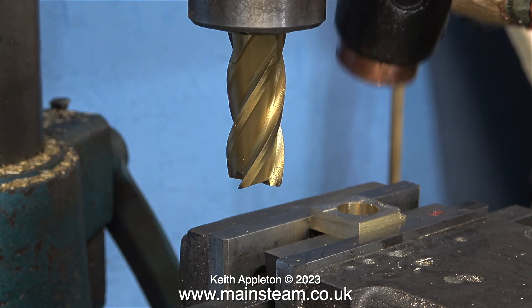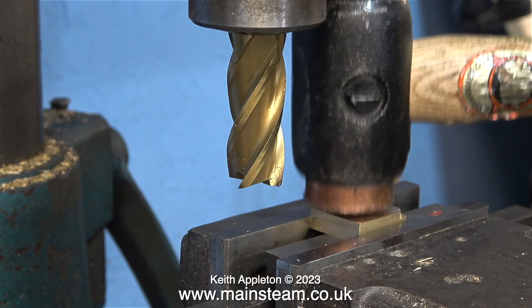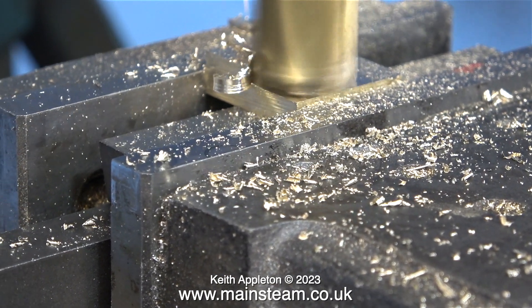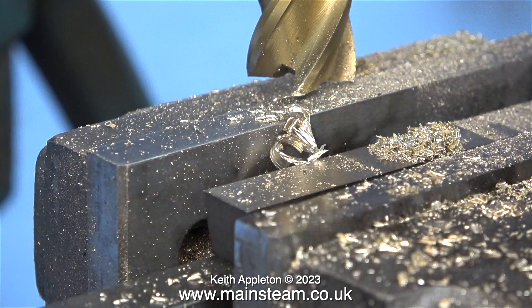It's at this stage where I really do not want to foul up — I will not get a second chance. So I find some new packings, tap the first of the pre-machined blocks into the machine vise with the soft hammer. Without changing the position of the end mill, I remove the metal from every one of the blocks. Now I have four blocks that are all the same size.